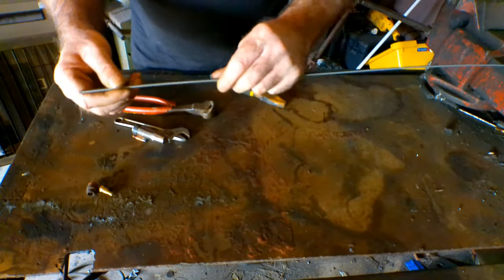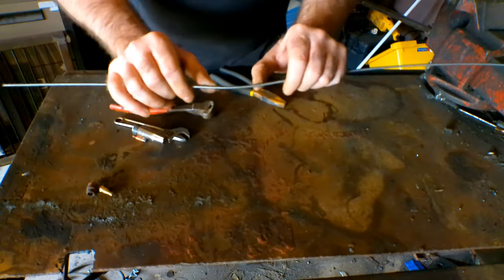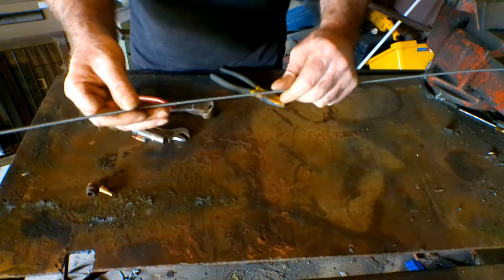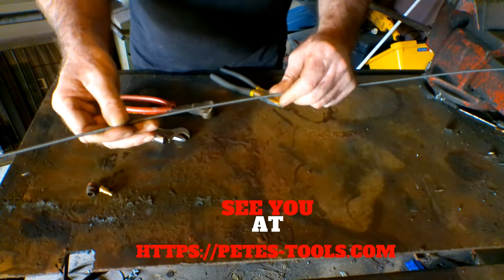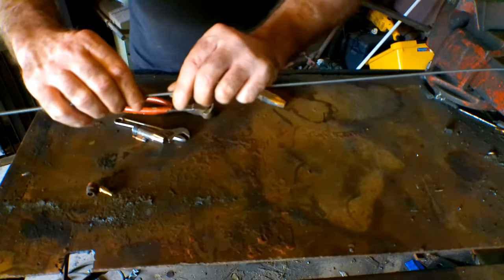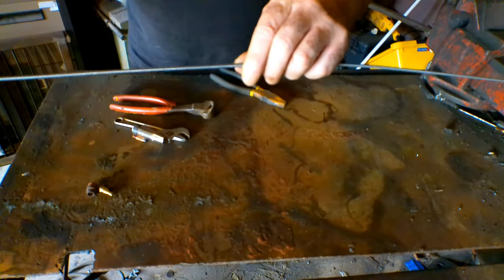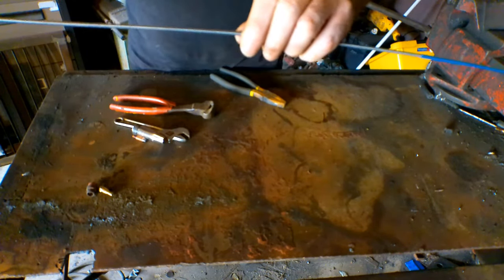So we've got the wire out of it now guys. Before we go and throw this back in there, we'll just run our fingers along it and examine it to make sure it hasn't got any kinks in it. Because if you have any kinks in this, you can have the same issue over and over again. And the price to replace one of these is two fifths of bugger all, so sometimes it's just easier to chuck a new liner in. But sometimes you're in the middle of a job and you're nowhere near a store, so you just make do with what you've got. If you just run your fingers along it like that, you can feel if there's any kinks in it. Feels like there's a little bit here — we'll probably get away with that.